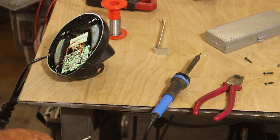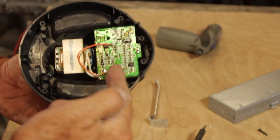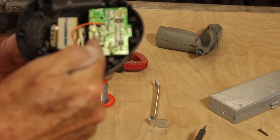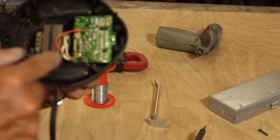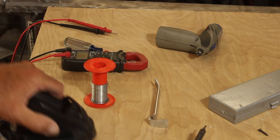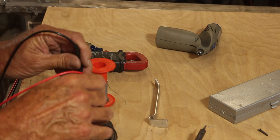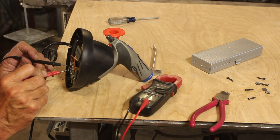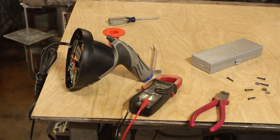Okay, let's see if anything smokes. Now all I've done here is put a couple of dropping resistors in between that bridge rectifier to bring the voltage down to around 10 volts, and I've just jumped the bridge rectifier output right over to the contact pins over here. With no load I've got about 12 volts. Checking the voltage while it's under load I'm getting seven volts, which is right where I want that actually. Now we'll let that charge for a while and see if we get our Dremel back.